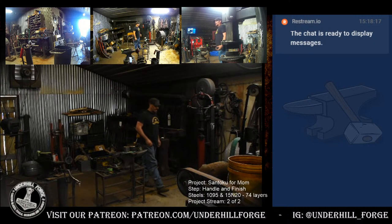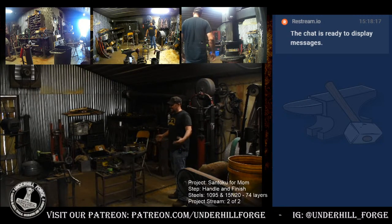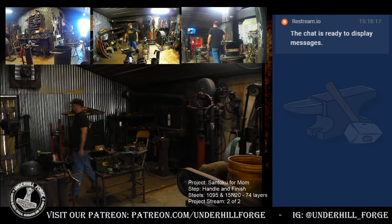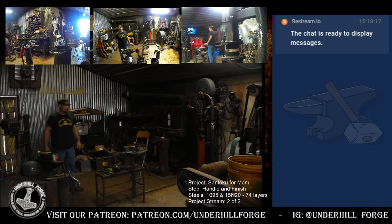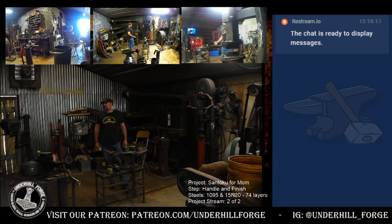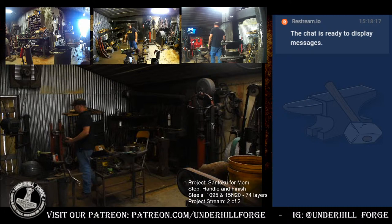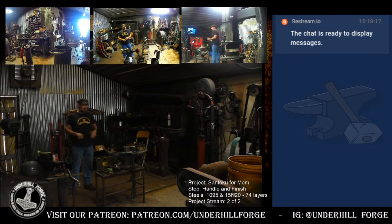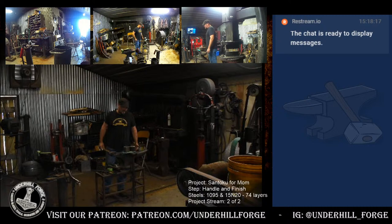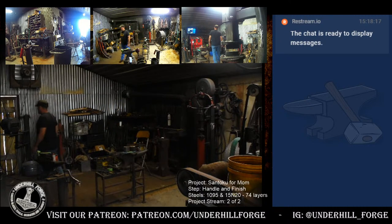All in all, it's probably going to take an extra 25, 30 minutes just to get everything to set up to the point of being able to use it. Because they call it 5-minute epoxy. However, what they really mean to say is if you mix it completely equal under absolute ideal conditions, then it would be 5-minute epoxy, but otherwise, it's probably closer to 12 to 15-minute epoxy.